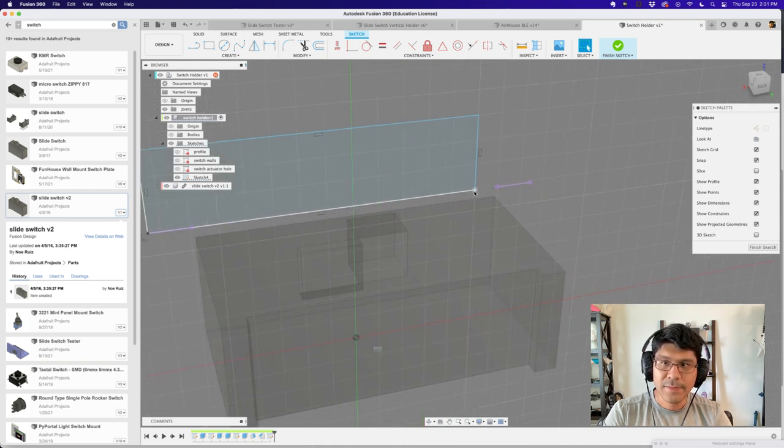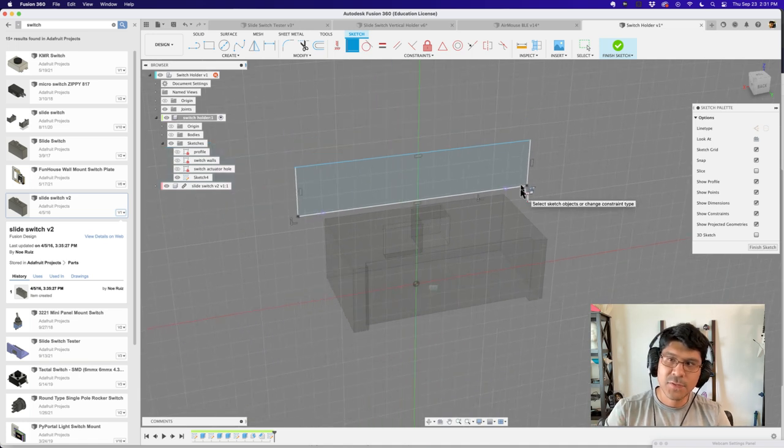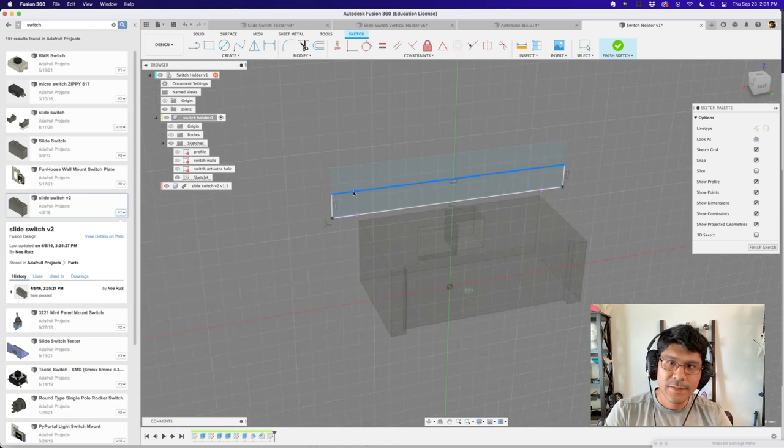And then I'll do the same on this side here. So just drag that. And if things get weird, I can just select that, hold down shift, select that dot, bring up my design shortcuts, and assign the coincident manually like that. Just because sometimes Fusion selection will be a little bit weird. So that's one easy way to do it. And that just leaves me with this.